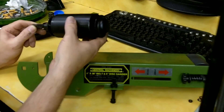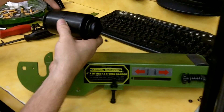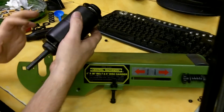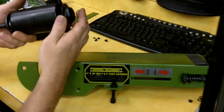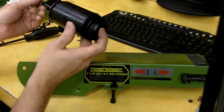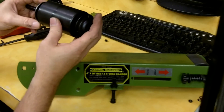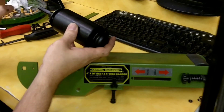Similar to the other procedure, I'm going to chuck it up in the lathe and turn across this to flatten this area out. What I'll have to do on this one is get this cap off here — I haven't determined how to do that yet since I just took it apart — so I can hold it on centers on both sides and drive it with the dog like I did in the other video. That will allow me to turn this concentric to the shaft.